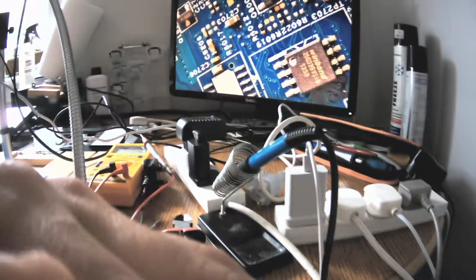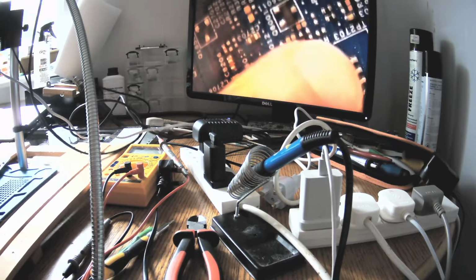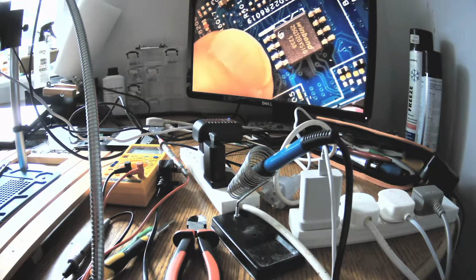So today we've got a main board. It's an HP laptop. I've got a BIOS. Where are you? Here. And we've got a second BIOS chip, and we need to just replace it, yes? So that's a Winbond 25Q32B.